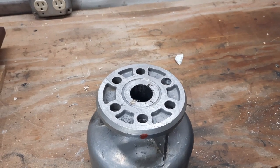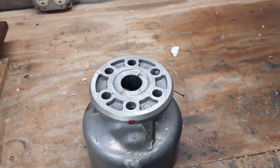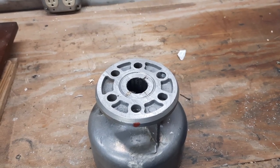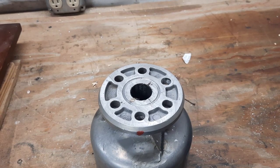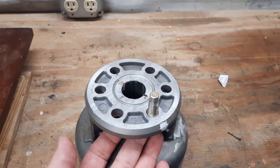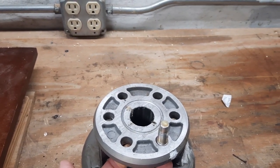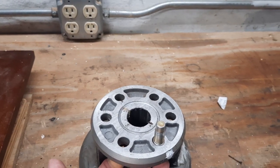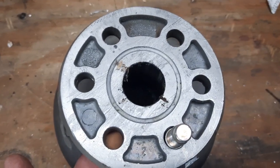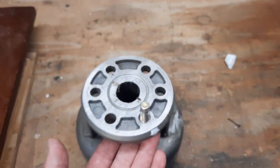The coupling is bolted up to the motor with six 7/16ths fine thread bolts. What I had done was put in five of them with hardened studs and left one that I reamed out for a body fit shoulder bolt. I thought that body fit bolt was going to give me perfect center, but I think I shot myself in the foot. When I reamed out that hole, I didn't do it straight, so I think that was a large part of my problem too.